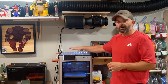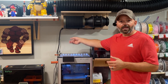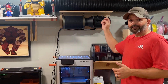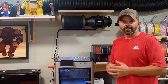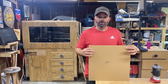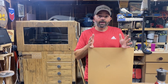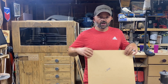In this video, my plan is to make a new top for this enclosure with a vent in it — either a screw cap or a friction fit cap — so when I print PLA or PLA silk, the unfiltered air leaving the chamber goes up into this filter, gets filtered better than the chamber itself, and is then blown into the environment harmlessly. The perfect material to mimic the glass top is a quarter-inch piece of cast acrylic, which is much better and easier to machine than extruded acrylic.